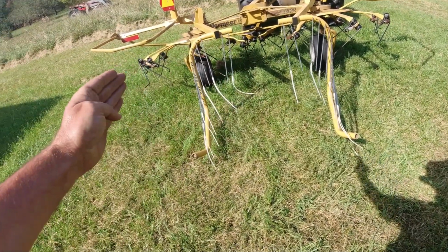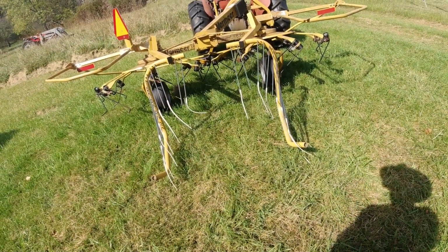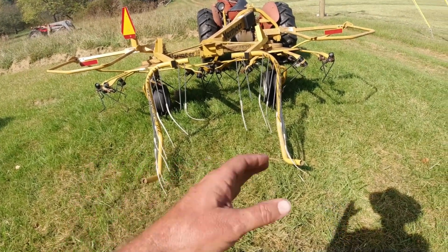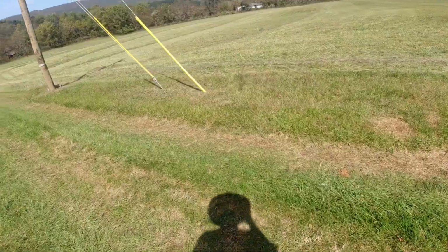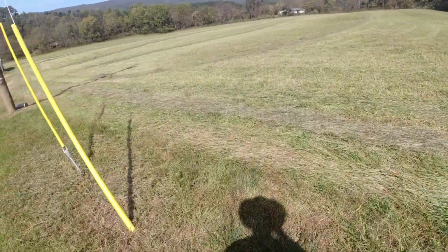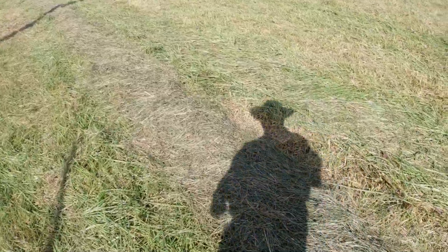Those cages are adjustable, as I have shown in another video. I actually had it set to make a windrow as wide as the pickup on my John Deere round baler. Today I've got it pulled in a little bit because we're not so much going to rake this fourth cutting hay out here in our east field. We're going to kind of fluff it up.